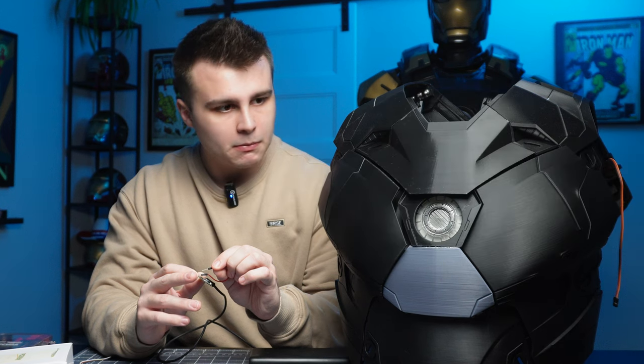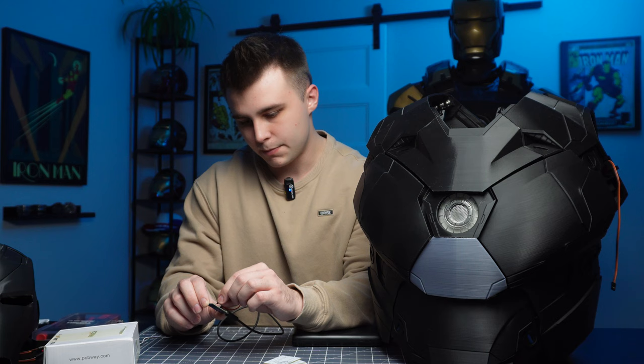This whole setup is just using Crash Works 3D's helmet code — I slightly modified it. All I had to do was add extra servo pins for six extra servos and associate them with unused pins on the Arduino board. Once that was done it was just troubleshooting, figuring out the correct servo angles, speeds, whether or not some servos should detach or attach and when, and adding some simulated delays. You'll see that those two panels open and then the panel at the top opens — that was just using simulated delays. If you'd like to see a tutorial on how to modify the Crash Works code to build basically anything — a missile launcher, whatever — please leave a comment down below.